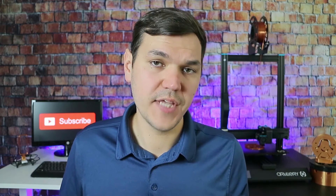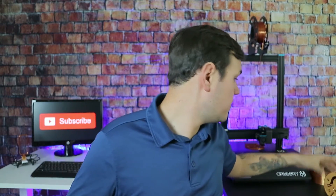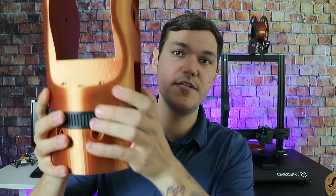If any other parts in the build are bigger than that, I'll add it in the comments. This piece took 22 hours to print at 0.2 millimeters layer height and 30 percent infill — a relatively large print that took a long time, but it turned out pretty good. Here are the first three pieces stacked up so you can see the size — it's going to be a substantial arm and I'm pretty excited.